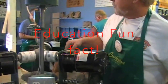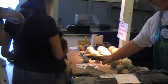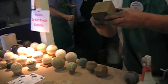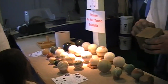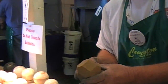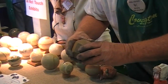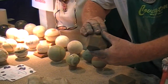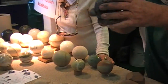We're making the rocks like this right here. They're called spheres. Start with a rock like this, cut this rock into a square. Take this square, put it on the saw like that, cut all the corners off. It comes out looking like this. Put this on a bench top grinder, pull it against the grinding stone and roll it until this gets round, then we turn it. Roll it again until that gets round.